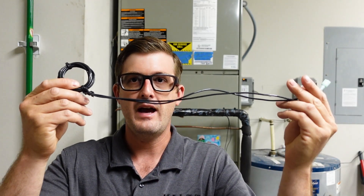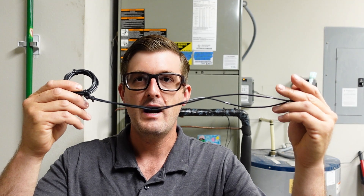What this also serves to do is move your measuring point away from other wires. I can move this out of the unit, away from other wires that might be interfering with my reading. I'm going to demonstrate using it on an air handler low voltage circuit and also on a condenser fan motor. Some other uses could be to test small defrost heaters for refrigeration — anything where you need to critically measure low amperage.